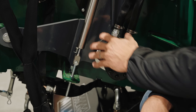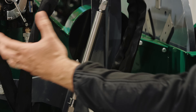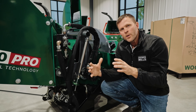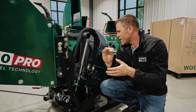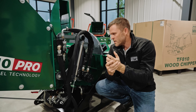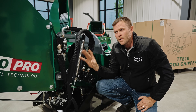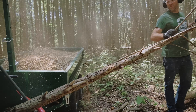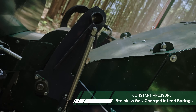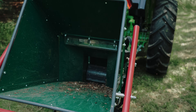The infeed motor is mounted to our swing arm that pivots at the rear, opening up to allow material to flow under our infeed roller. In this chipper, we use an 8-inch diameter by 10-inch wide roller with chisel knife edges welded all the way around it — we find those superior for climbing up over material as you first start the infeed. We've opted to use stainless steel gas springs on our Pro Series, which gives a more consistent force right from the start than conventional coil springs, and also provides a dampening effect as material changes size, keeping constant pressure as it feeds through.